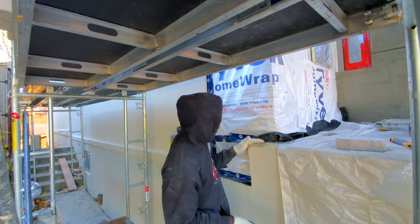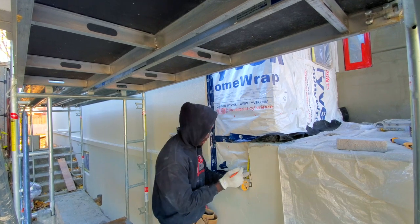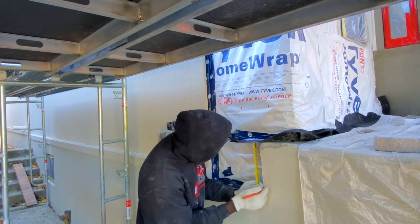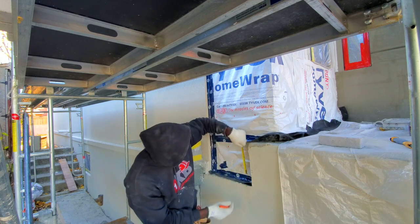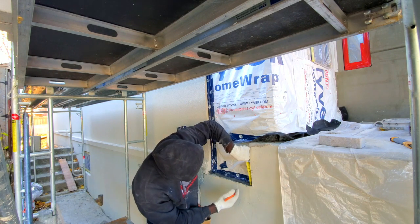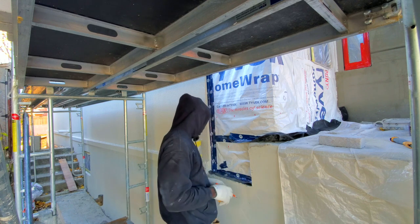Up to the level of here. We're just gonna measure, I believe, our biggest size stone. 8 inches, the biggest size that we have here, plus a 1/2 inch joint. We're gonna have to make a cut for this. We have to cut this around 4 inches, so we're gonna cut it 3.5 so that we have a nice joint running on the here.